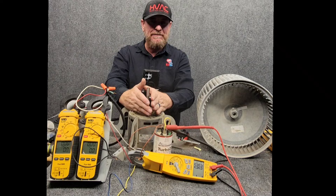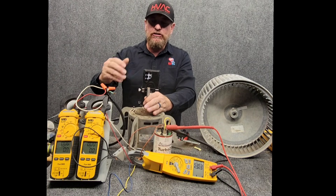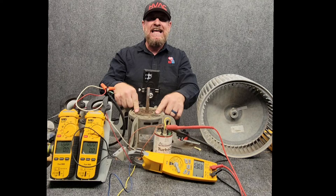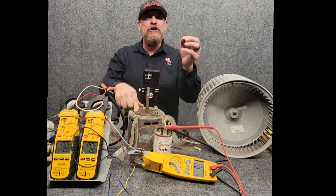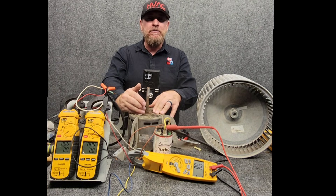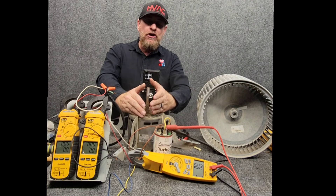Once we put the weight of the wheel on, that slows it down, and also how much air resistance we have — that difference is the slip. When we use lower speeds, we actually tap the windings in a different location, and it makes the motor weaker — it adds more resistance and ultimately makes the motor weaker.